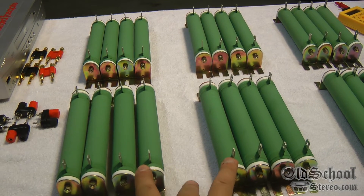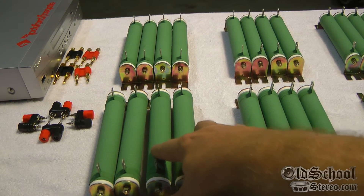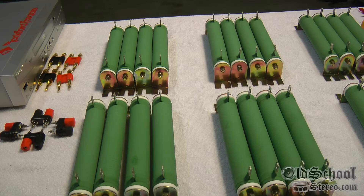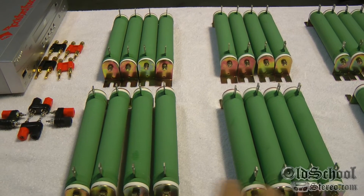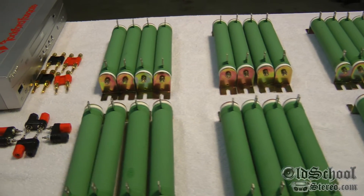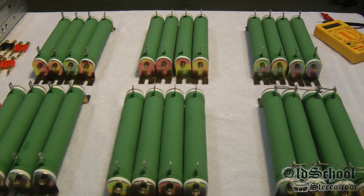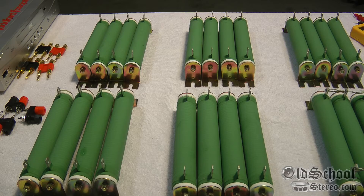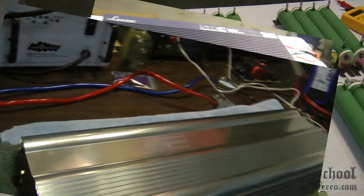We're going to have the ability to do four-channel amplifiers at two-ohm loads, because we'll be able to use two sets of these for one set of channels. Each set is four ohms, so parallel two together and you get two ohms. And by paralleling all 32 together, that's going to give us one-half ohm — meaning we can test the Lanzar Opti 50C and US Amps VLX 50.